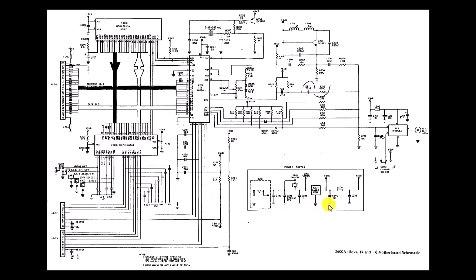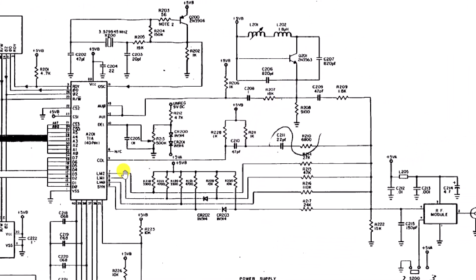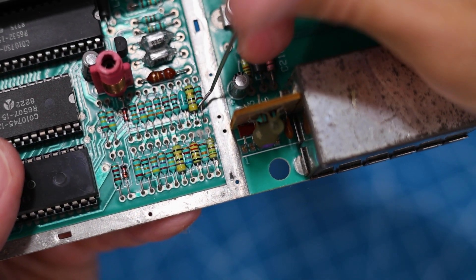To figure out how to separate the audio and video, the best place to turn is to the Atari 2600 schematic. The Atari I'm modding today is the CX2600A model, so that's the version of the schematic we're looking at here. Here's the TIA chip, and you'll notice two audio lines coming out of the TIA, which are summed together, fed into this audio adjustment circuit, and then combined with the video signal. To separate the audio, the easiest approach would be to just clip one of the legs of this 1.8 kiloohm resistor, R209. And when looking at the board, R209 is right here.